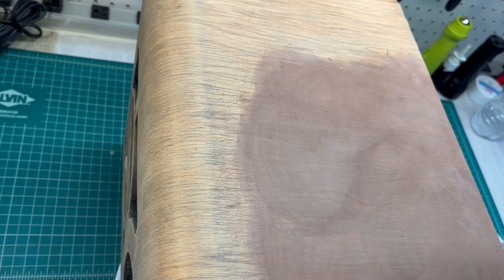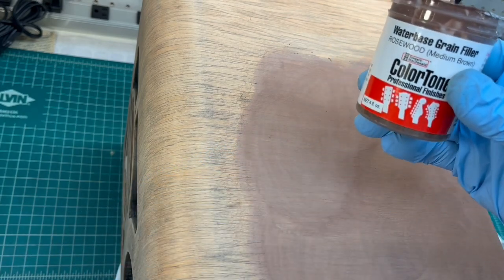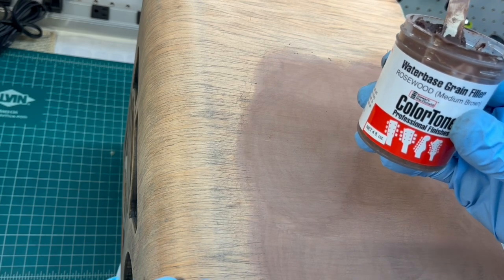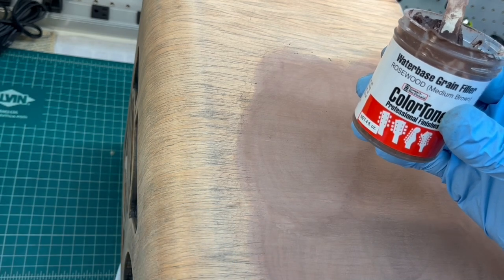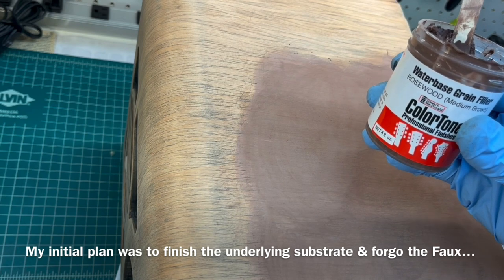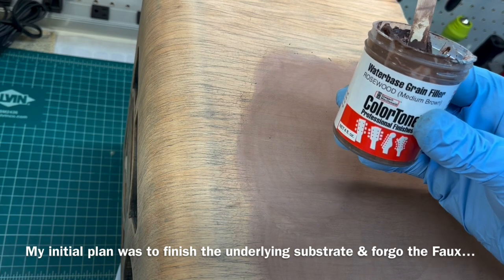I've got all the cabinet repairs made to the best of my knowledge. And you can see I'm gonna use a different type of grain filler in this case. It's one I've had for a while. I wanted to tint this cabinet more of a brownish color before I apply some reddish stain over the top, and then probably go back over to blend some toners in as well.